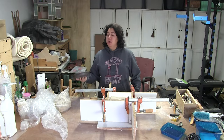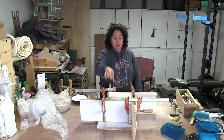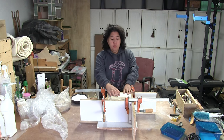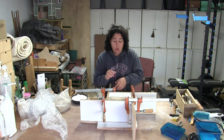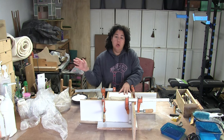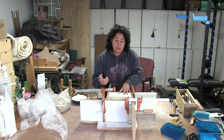I'm going to take this apart, flip this over, and do the larger half, leaving the bottom little chunk where the base is — I'm going to do that last. Whenever you have plaster-to-plaster contact, you want to make sure you put a good release on it. I'm probably going to paint a coat of release on it, let it fully dry, come back and paint another coat before I pour my plaster.